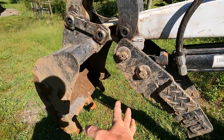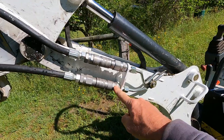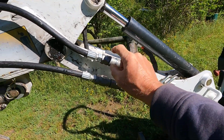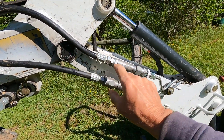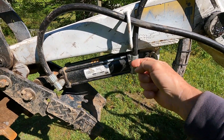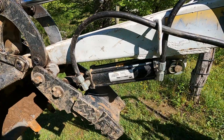The bucket should be able to push the thumb back a little bit when you close it and grip something. The Bobcat comes with auxiliary hydraulic lines, so all you have to do is get some quick disconnects made and get these hoses custom made at your local shop, and it connects right up. It activates the cylinder from the top and returns vice versa when pulling the thumb back.